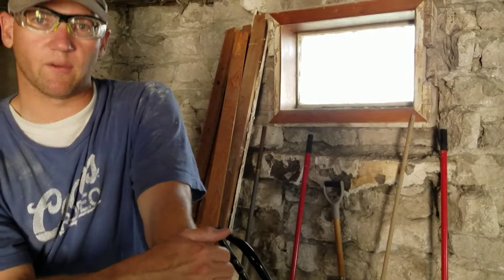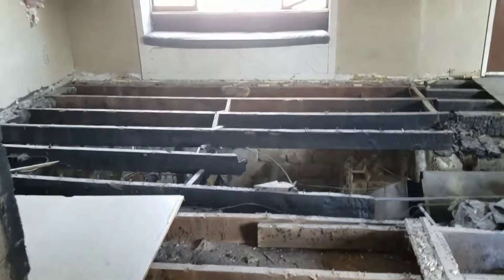That's about all we've got going on right now in this old house. We will restructure those floor joists there in the living room where they've been burned out. We'll get some wood to walk on so we can fix the floor and tear that rock out. We'll re-brace some of those so we have support for the weight before I tear it all out and put a new floor in, so I'm not destroying my new floor.